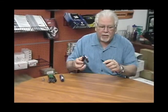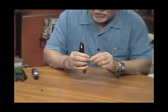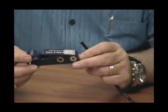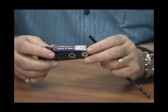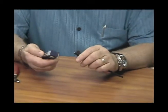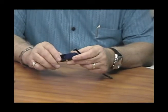First thing you want to do is prepare the cable correctly. I always like to cut the cable first and square it off at the end. Then the next thing you want to do is grab the strip tool. One thing I do in setting up my strip tool is I always add a piece of Velcro on the top of it. This gives you the ability to comb the braid down instead of always using your fingers. So once you've got your strip tool set up, make sure you have it set on, in this case, RG-59 cable.